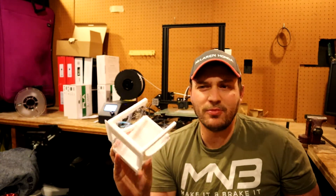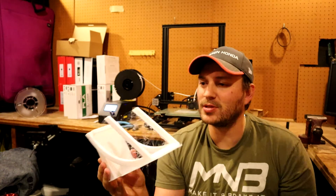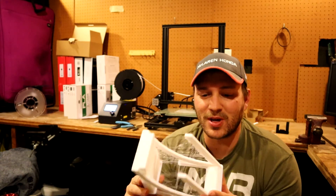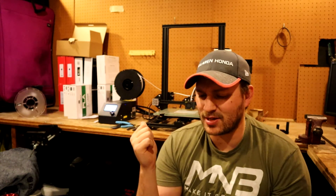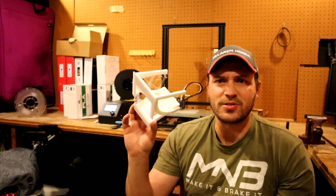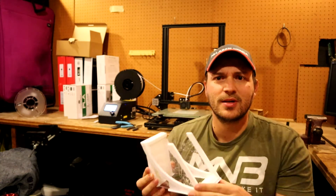The print has changed on the CR-10 because what was on there failed horribly — not really due to the printer's fault, although you can see with the amount of stringing going on, that wasn't a good print. Actually, I loaded the print material wrong. There's a way to load printer material in the middle of a print, and I did it wrong because I'm used to the RAISE 3D, which is completely different. But for this other design, it looks like we have a pretty decent design going. We changed the print because we actually found maybe some of our issues with this printer.